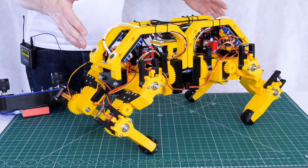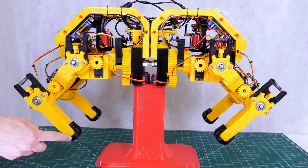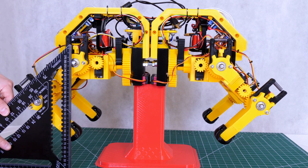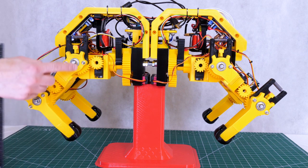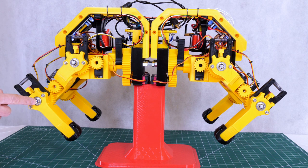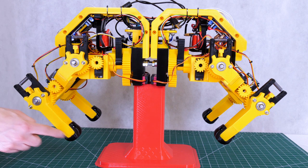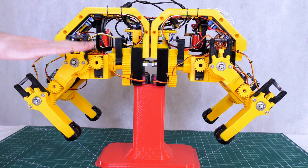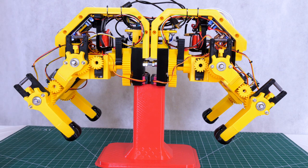The rest of what we did last time is getting scrapped, and we'll make it walk again with the kinematic model. The first part of the kinematic model is solving the leg length from the hip to the ankle and trying to move the ankle up and down in a perfectly straight line. The foot is directly below the shoulder joint at the moment. What we need to do is modify both the shoulder and the knee joint as we give it a length for this distance. We can use trigonometry to work that out, which means we should be able to move the robot up and down in a perfectly straight line without its feet sliding sideways. That's the first axis of our kinematic model.